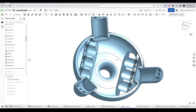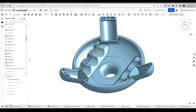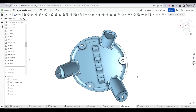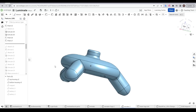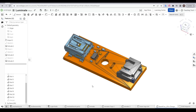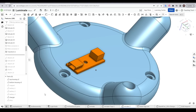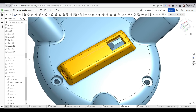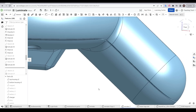After this, it was basically a lot of detail work — creating slots for the battery terminals to clip into, some chunky guides to hold the cells in place, and bosses for screwing the two halves together. Of course, all of this needed to be matching on the lower half. This gave me the basic shape, but I still needed to integrate the switch and the charger. SparkFun had an STL of the charger which I imported, used to extrude the key components, and derived it into its intended position. I then built up a housing to surround it, added a cutout for the switch to pop into, and merged everything together.